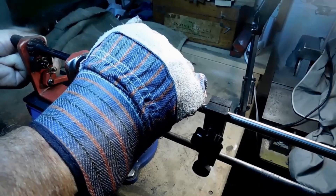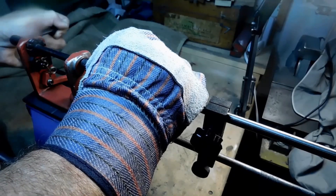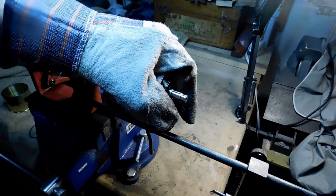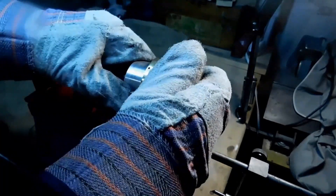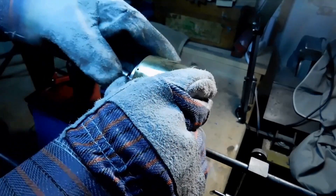I got it in there — you can just barely see the two inches out the backside. Now I've got to release the pressure off so I'm releasing the pressure inside the sleeve, so that the sleeve will be holding it and not the winder. Now we're going to take the tailstock off — we don't need that anymore. We're going to slide the barrel over top of it with the hook up at the top and find where that hook slides nicely right behind the sleeve. It clicks right in there, and now we'll just turn it a little bit until we can feel that the hook on the barrel has grabbed the mainspring.